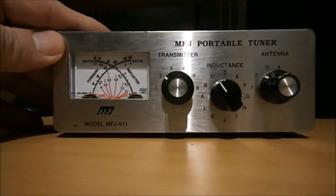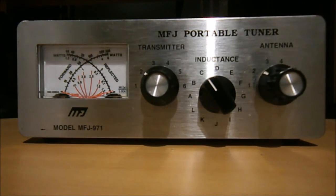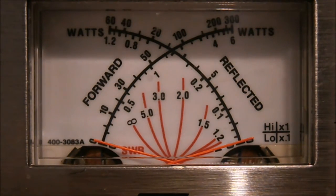I like the little meters, as I said — so you can see what's going on. I'm going to open it — actually I'll leave the screwdriver, there are plenty of videos online showing what's inside. Let me show you a little demonstration of this antenna matching unit in action. I'm on 20 meters PSK — clicking transmit now so you can see the power going out, nice flat SWR. Running about two and a half watts; I never run it at full tilt — five watts flat out. You can see that's quite tidy.